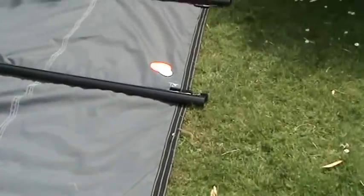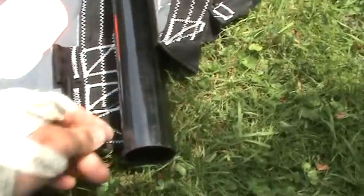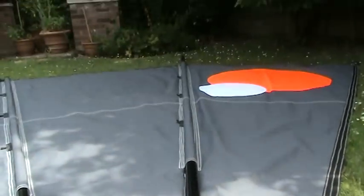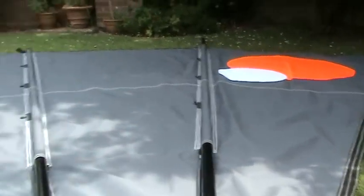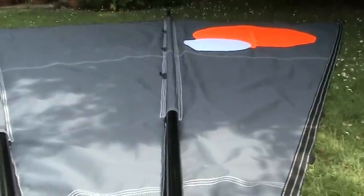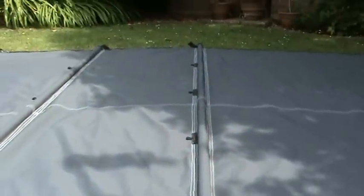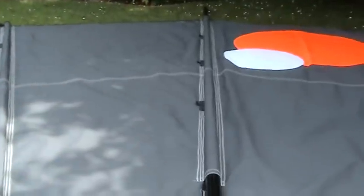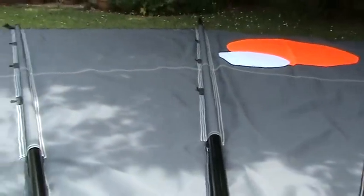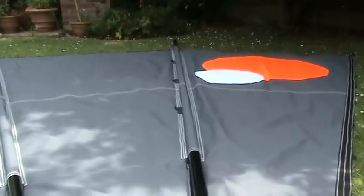You may also notice, coming back up the sail, that the top batten is actually a bigger section than the others. This is my storm canvas — these top two panels — so I need to get maximum strength there. You'll also notice those little three black tabs, so that if necessary I can lash battens together, or if I do break a batten, I've got the means of putting splints in or whatever.